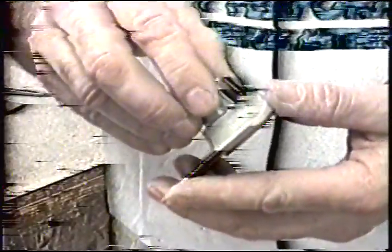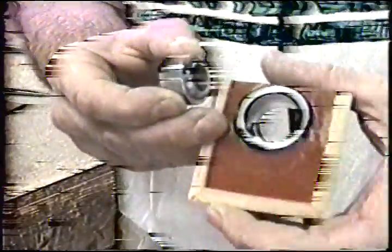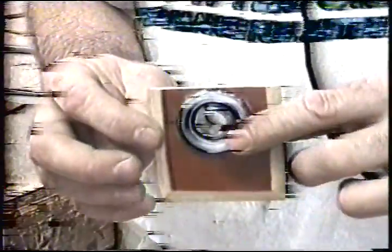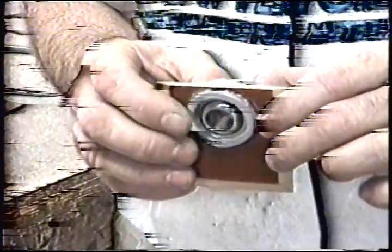So take the gloss off the back side. Make certain that there is no epoxy left. Oops, wrong side. I'm watching the video monitor, and make sure it drops in. Click, nice fit. And now we're going to show you the positioning of this on the inboard end of your wing, and this will be the left wing. Before you, you have the inboard end of the left wing.